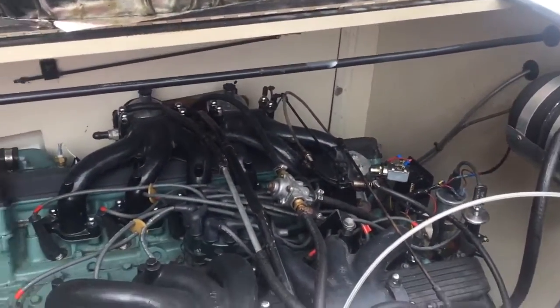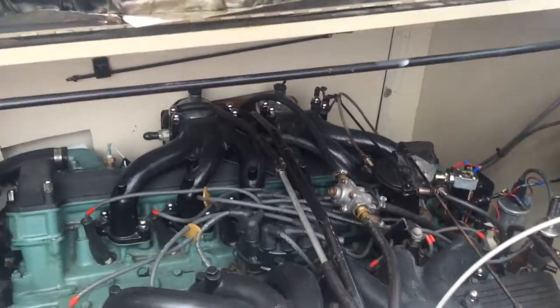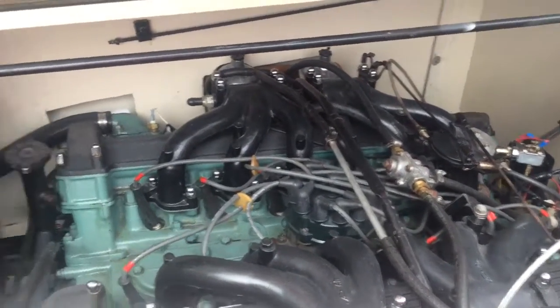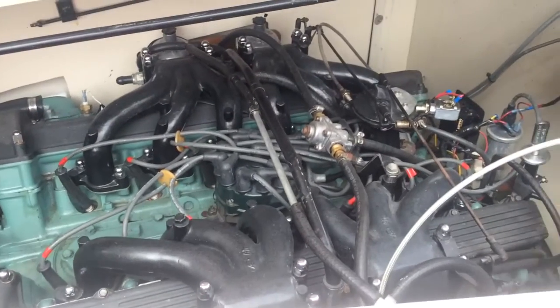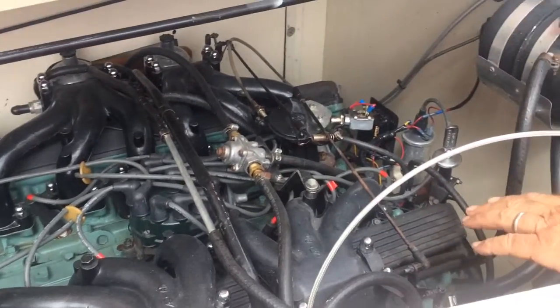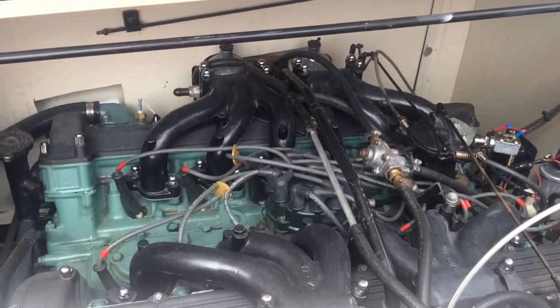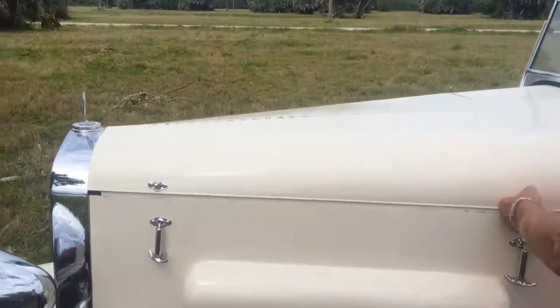These are very smooth running engines. One of the nice features about the 12 cylinders, other than they run smooth, is that the torque curve throughout the RPM range is very consistent. So this engine develops a lot of torque. The transmission that I used on this version of it is actually a Borg Warner Model 12 3-speed transmission. Okay? So we'll shut it back down now.